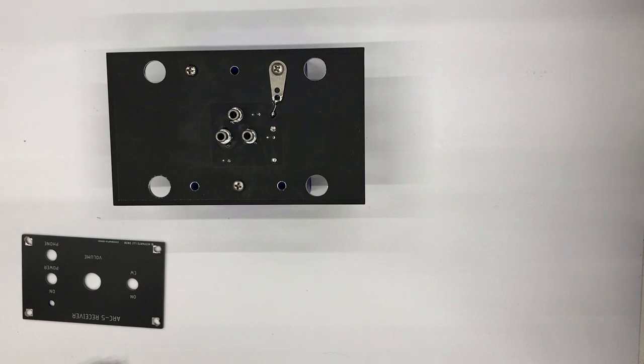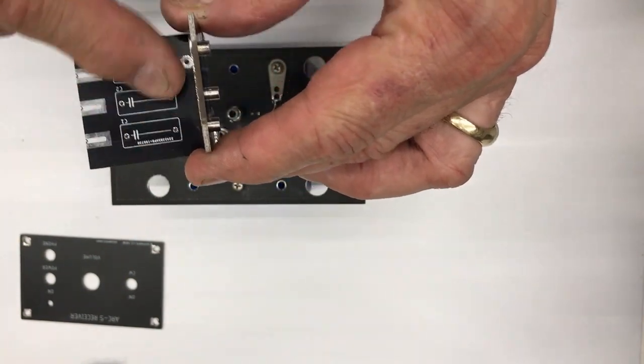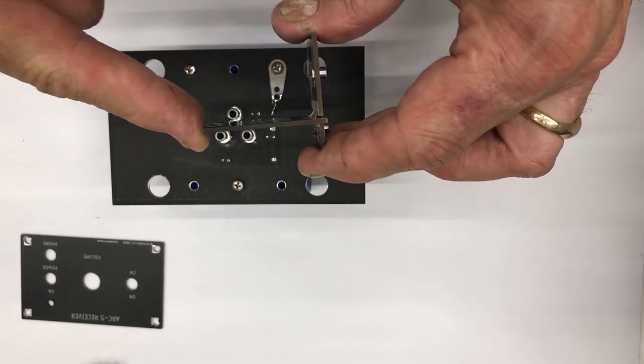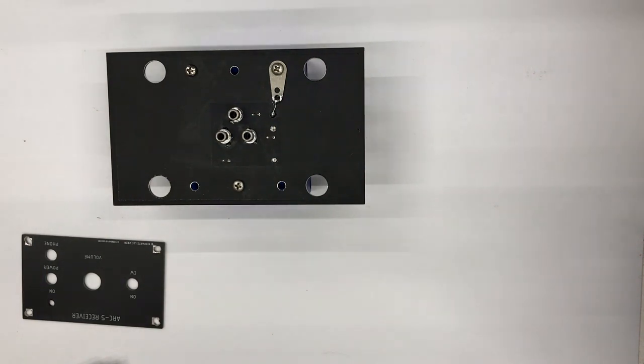Lastly, I found a small 5k-to-voice-coil, 5k-to-8-ohm transformer. Many of these radios had 180-ohm and 600-ohm outputs, so you ended up needing another transformer to modify that impedance to run a loudspeaker. What I ended up doing is using one of these brackets — without the capacitor piece — to mount this 5k transformer so it fits exactly back in the space of the original transformer. So to reiterate: when my radios are done, they run on 12 volts, draw 2 amps, and will run a loudspeaker.